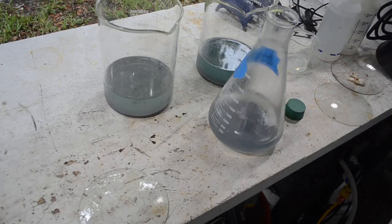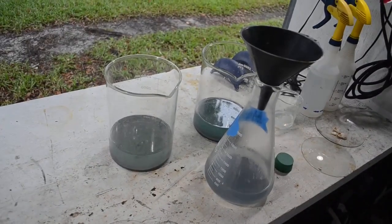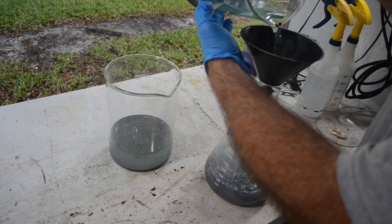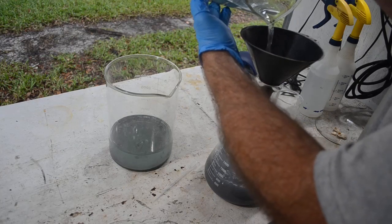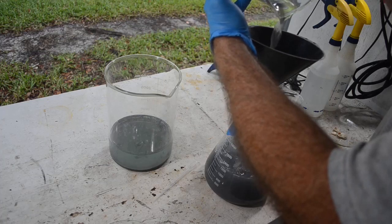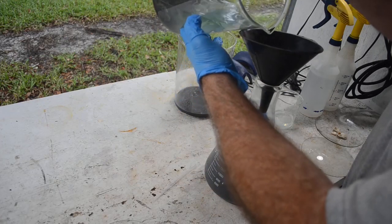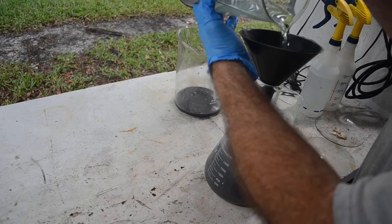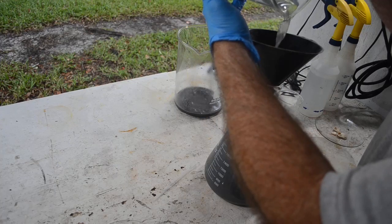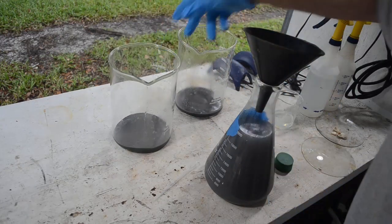So I've got a flask here with some used nitric acid solution in it. I'm just going to add this stuff to it. And in the future, when I get around to doing the next batch of concentrates, I will use this liquid in here to extract the base metals. I may have to add a little extra nitric to it, but that's okay. And as we use it for batch after batch of material, maybe we will concentrate the silver in there until it gets up to something recoverable. Maybe, maybe not. But certainly we won't waste the nitric acid. Just enough room in the flask. Okay, good.